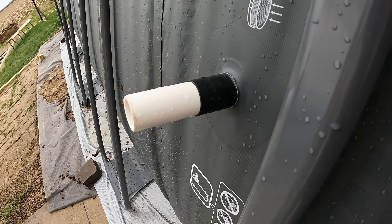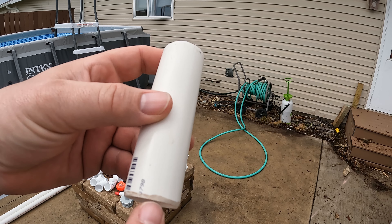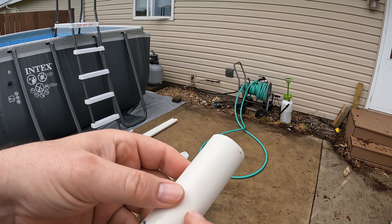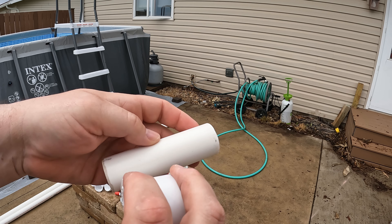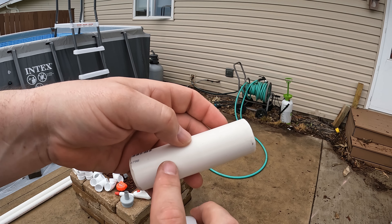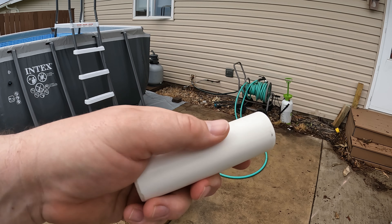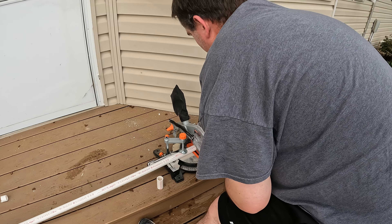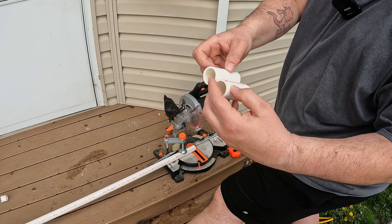The rain's passed, we're back at it. There's that one tube coming out of the pool — we'll put a clamp on there just to make sure. I'm going to do the same thing to this second one. I just don't remember how long that was and they need to be the same length. So I got a tape measure, measured it — I'm going to cut this down to three inches. The part on the pool is about two inches long, and I'm going to have this stick out an extra inch so I can put this adapter on there. This adapter is about an inch deep, so I'll cut this down to three inches — it'll stick out of the pool one inch, connect the adapter. For now I'm just going to cut these down with my little saw and get the lengths I want.